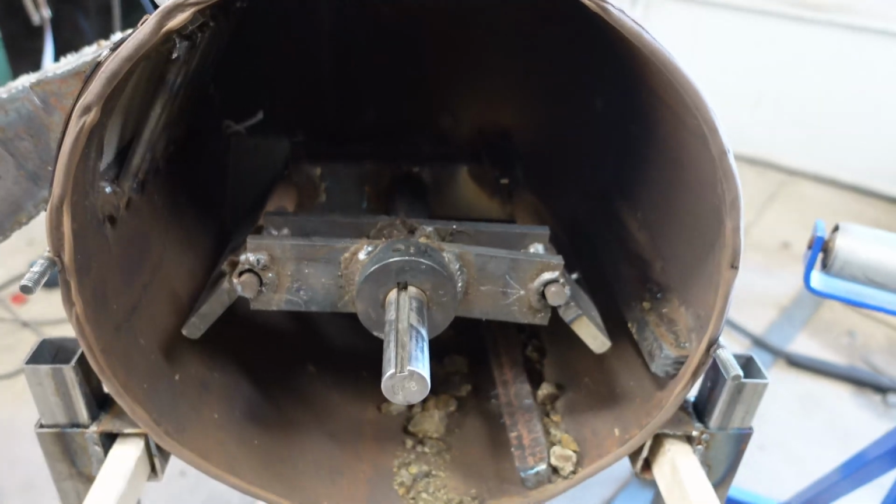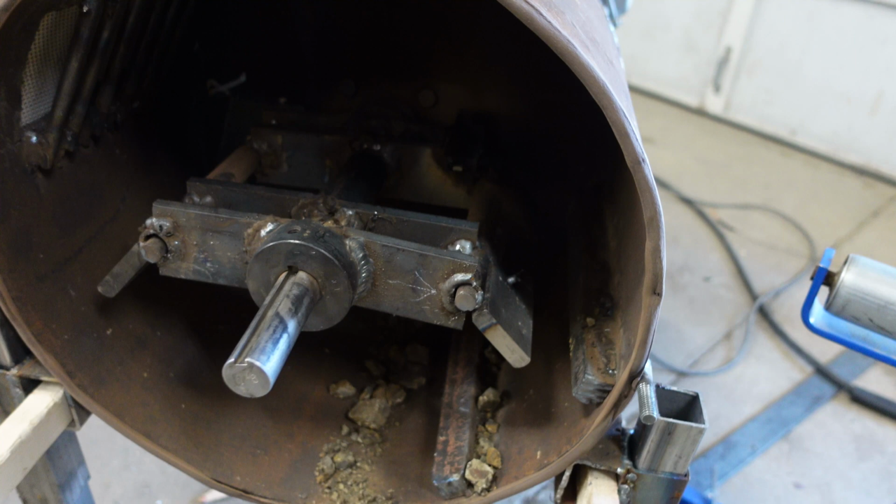So the last thing I want to address real quick off the other videos was the spacing between the hammers, the impact points, and the outside of the mill. I think several people commented, make it real tight, under a 1/4 inch. And my original intent after reading those, probably because I wanted those slats in there, was to make it about a 1/2 inch. Well, that's not what happened at all. After doing some modern day math and screwing up the calculation somewhere, I wound up with those about an inch, almost 1.5 inches off of the outside wall. I thought that's going to be a really big problem. I really screwed up on this math. I don't know what I did, but that was not the original intent. And as you could see, when I threw that rock in there and it beat around, those things spun around there for quite a while, even after the Lovejoy connector broke. I was like, man, this is not going to work out well. Look how much rock it left behind. But you'll see later in the video that it turned out way better than expected.